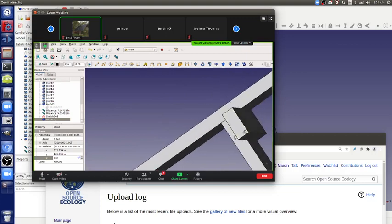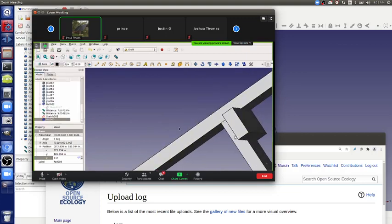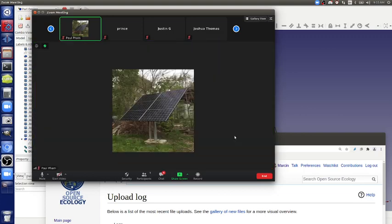Okay, next person do it. Do the next one. Where's the next block going to go? Let's continue going down. Let's do these end ones first. So what that means, we're going to be moving in two directions. The blocking is towards one side on one side, towards the other on the other. And that's what we actually did already for the second story platform. We're actually good there, because we'll work from the center and move on out, because that's the physical reality of the situation.